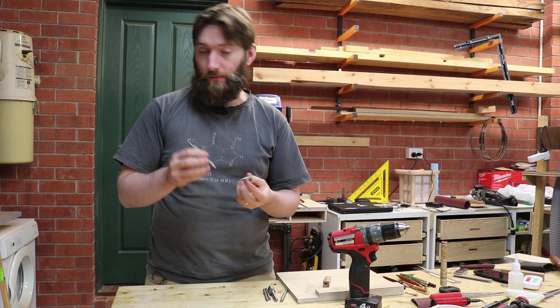The pen mill also has a series of teeth on the outside used to flush up the pen blank — cutting that end grain so it's flush with the brass tube — and a shank for attaching to a drill. You can put it back in your pen vise and do it at the drill press, or use a cordless drill, which is what I tend to do. Depending on the blank, you can either hold it in your hand or put it in a woodworking vise. For softer woods like Tassie Oak, maple, or walnut, holding it by hand is easy enough.